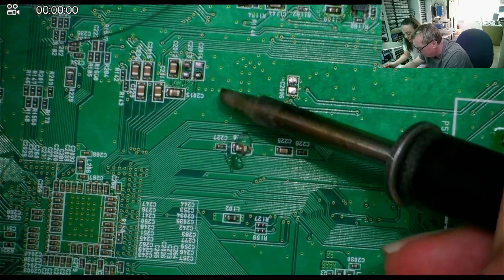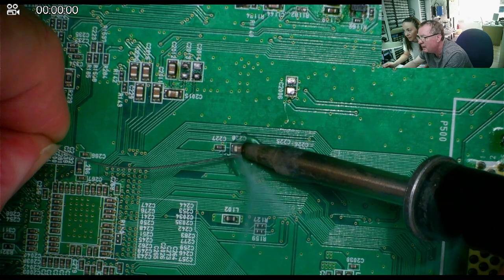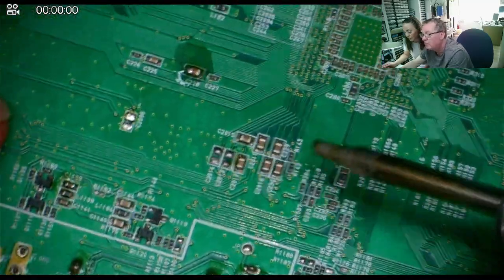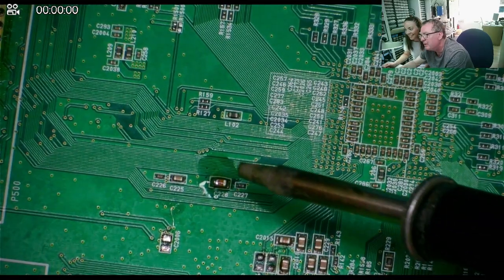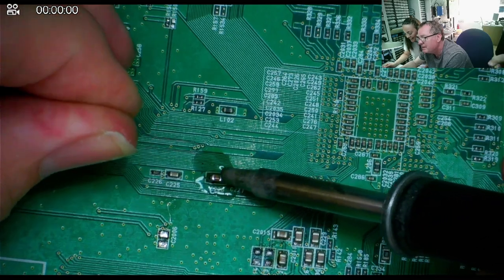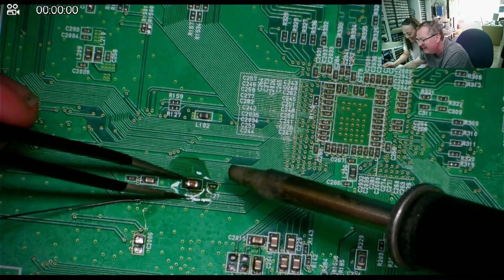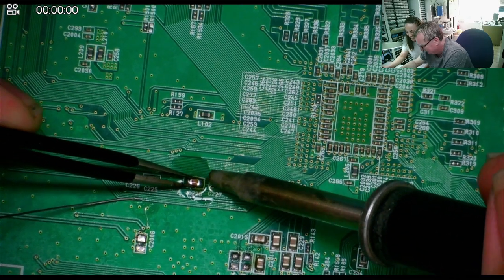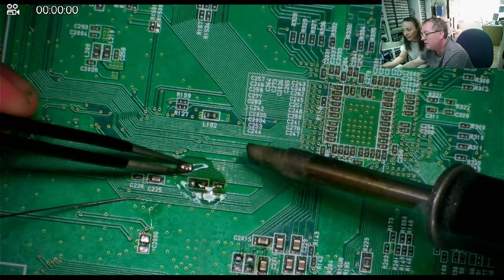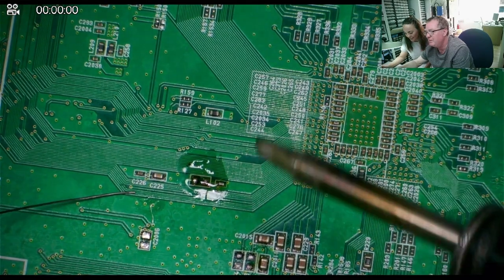So what we'll do is get the end of the solder wire. I'll bring the solder in and put a blob of this new solder on. Feeding wire in — it's actually shiny. So that's put some new solder on, and then we're going to turn it around. Another good thing with this flux — you can see where you were. Now we take tweezers. You use these for makeup? For similar things, yeah? I hold the solder iron just against it for a few seconds and this should come off the board. That's it — yeah, that's how it is. So really, that is how simple this is.